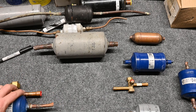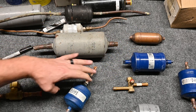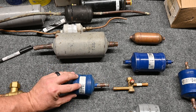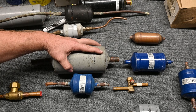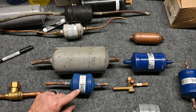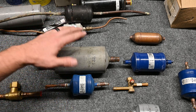If I have a burnout, I'm probably going to use a larger style filter dryer. I'm also going to use a filter dryer that picks up more acid. We talked about the different sizes — this one in the middle says 05; those first two numbers are really the desiccant size. This one has 05, where this bigger one over here is a 41 — so it's 41 cubic inch. It's a huge amount of filter material surface area, allowing it to absorb moisture. Whereas this one is a very small amount. You can go bigger; you certainly can't go smaller. So if I'm having an issue with a lot of moisture in this system, I would definitely want to go larger.